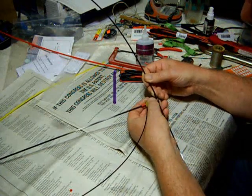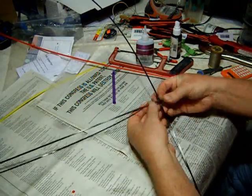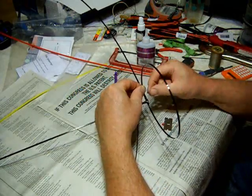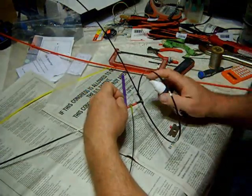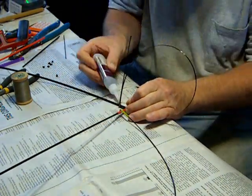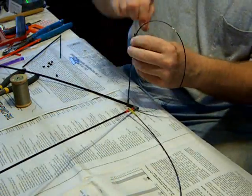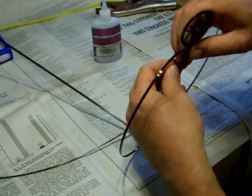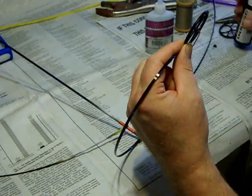When I attached my landing gear — the rear wheels of the trike setup — I decided to put small vertical stabilizers on each end. I used flat thin stock and reinforced the leading edge with a piece of regular carbon fiber tubing. My rear wheels are just lightweight plastic wheels on a piece of music wire in the shape of a U, attached with thread and CA onto the reinforcing rod I used in the leading edge of the stabilizer.